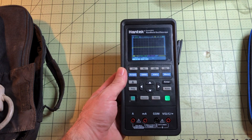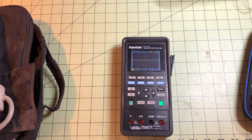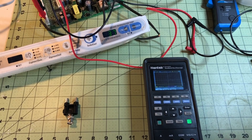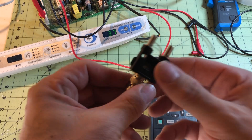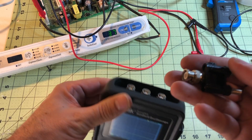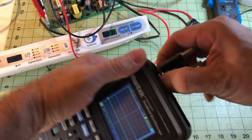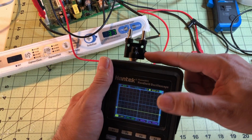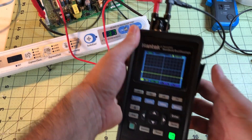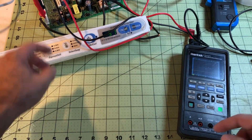I'm going to show you how to connect the oscilloscope. What you're going to need is this probe — the ground has a little nub sticking out. These are recessed, so if you have bigger fingers it's a bit of a chore to get in there and twist it, but that's the BNC connector — it's a twist-on. You can use standard meter leads and it does come with those. Now we're on battery power, so we're isolated with no risk of shock or damage.